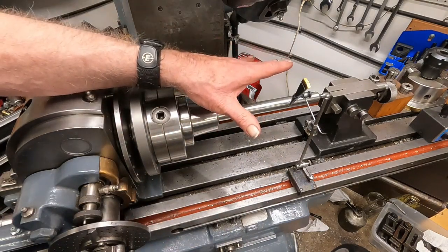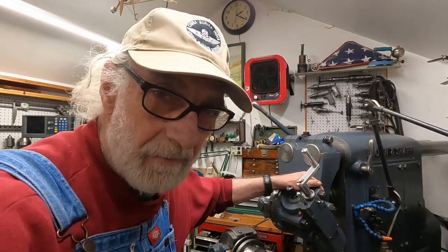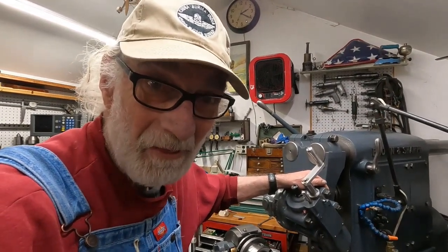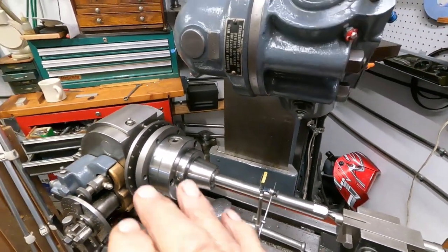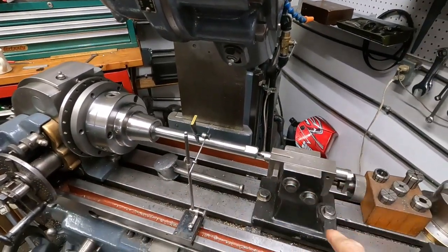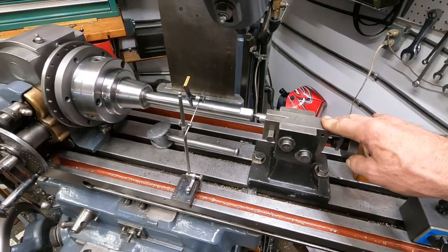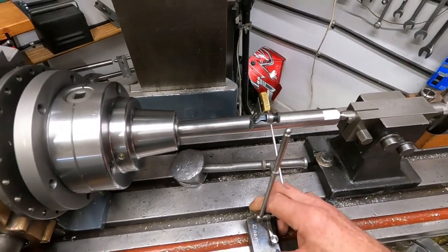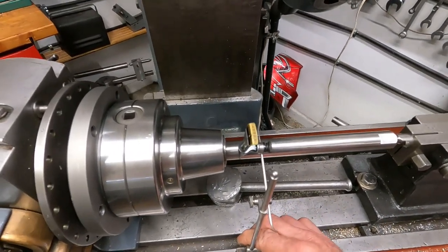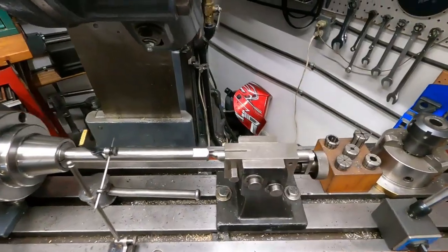Now I'm going to fiddle with that tailstock and we'll try another angle with the camera. This is one of those small things that did take a few hours to get done, but now I can put things in this dividing head and this aftermarket footstock and have them run within a thousandth of an inch, as can be seen on this antique Lufkin surface gauge and junior indicator.